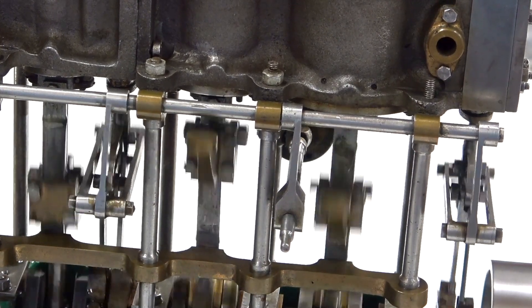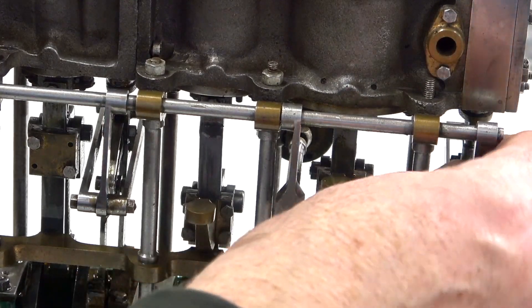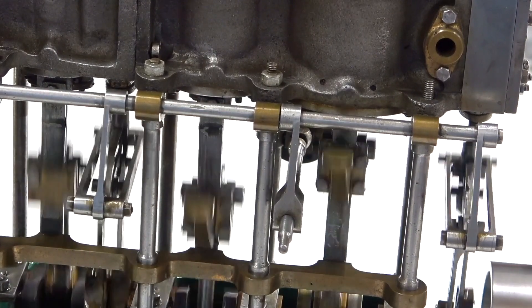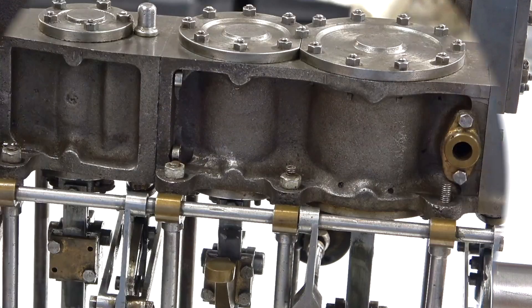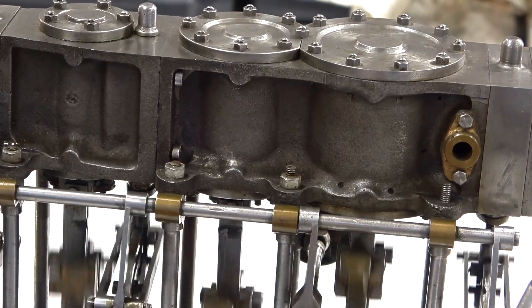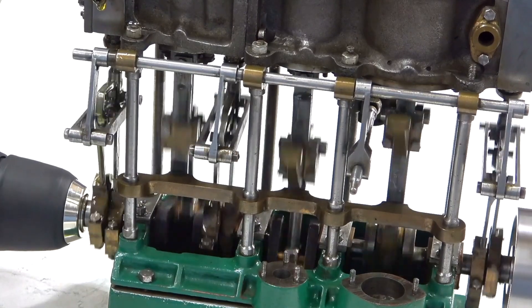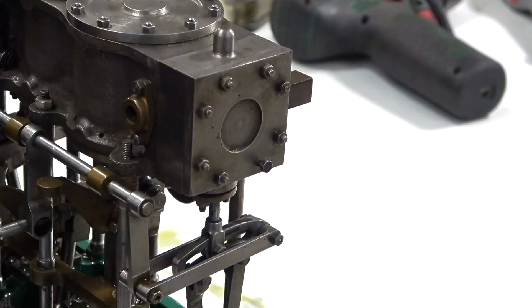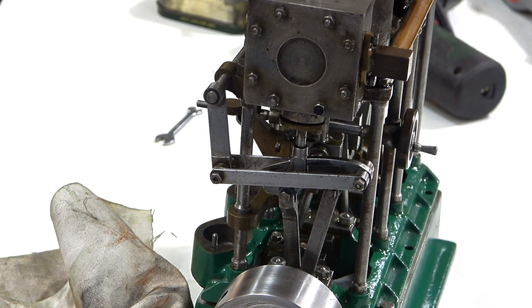The engine suddenly started working! In this clip you can clearly see how loose the valve gear is. Each and every one of the drop arms needs to be fixed to the main rod — the fun part will be securing them. I have my small Bosch electric drill firmly clamped to the crankshaft, rotating the engine to allow the oil to find its way through all of the cylinders. You can see how much effort it's taking. Earlier I mentioned blow holes in the steam chest cover castings — here are the ones in the steam chest cover of the low-pressure cylinder. This is purely cosmetic but it's bothering me. In the fullness of time I will probably make a new steam chest cover using this one as a pattern.